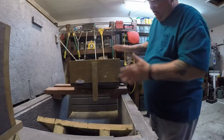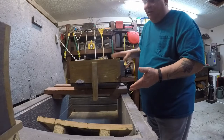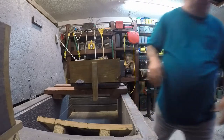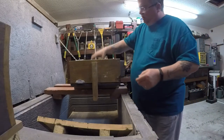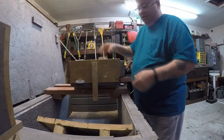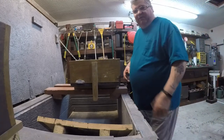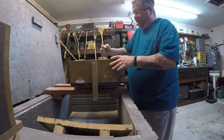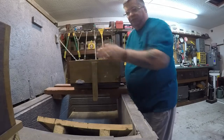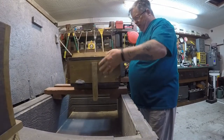Now, as you can see, I've got this set up as if I'm getting ready to ram up the drag of whatever it is — because maybe I'm making one of these again. I've got it down here, I've got it in the inside there. And five or ten minutes later, now what I have is sand that I vented. I struck it off — that's now nice and flat. I vented it, and now I'm ready to turn it over.